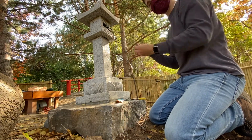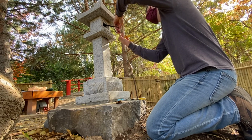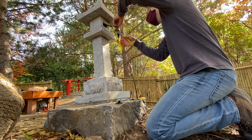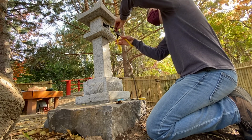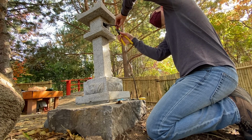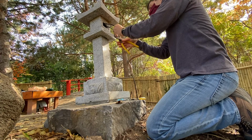And from there, I connected the wires and crimped them down, and I had to make sure the wire was cut just enough to fit into the splice but not be exposed in any way. Pretty much what the splice does is it connects the ends, it touches the ends, and then I crimp it down with the metal, and then it shrinks it, so it connects the two ends together instead of twisting them together.